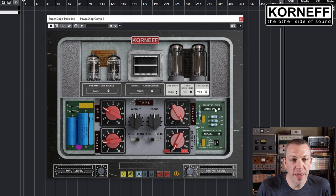The preamp also has the ability to change the type of resistors. We have metal film 1%, which is really, really clean, and they kind of get dirtier as they go down. You even have the option to change the transistor in the sidechain. There are two of my favorite compressors modeled here — the 2N5486 is a bit more snappy, and the 2N3820 has a lot of pump.